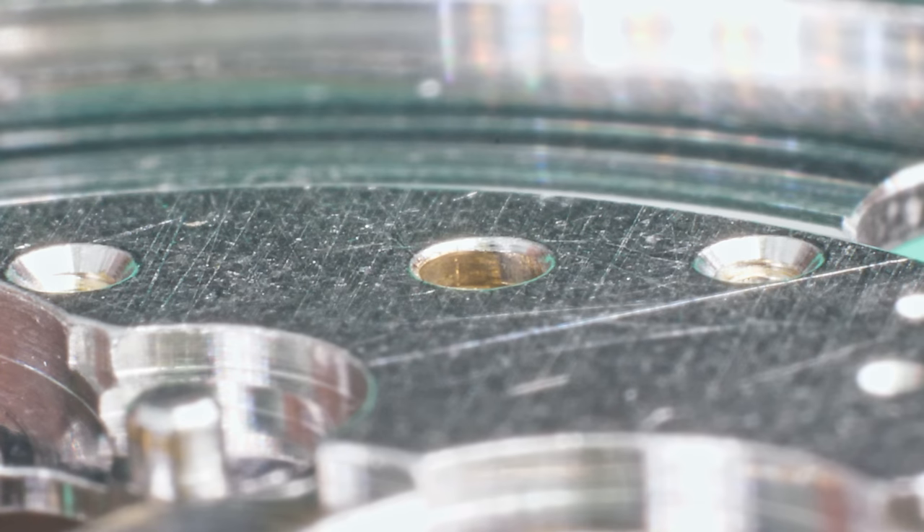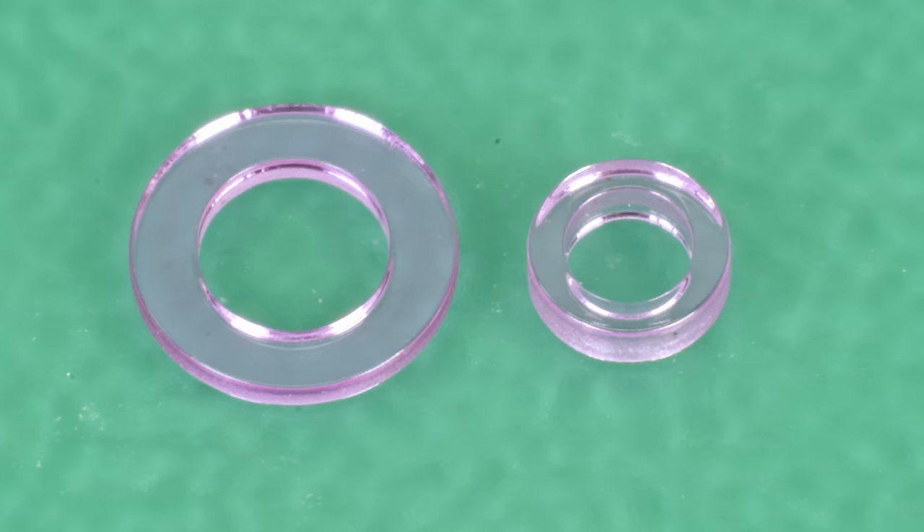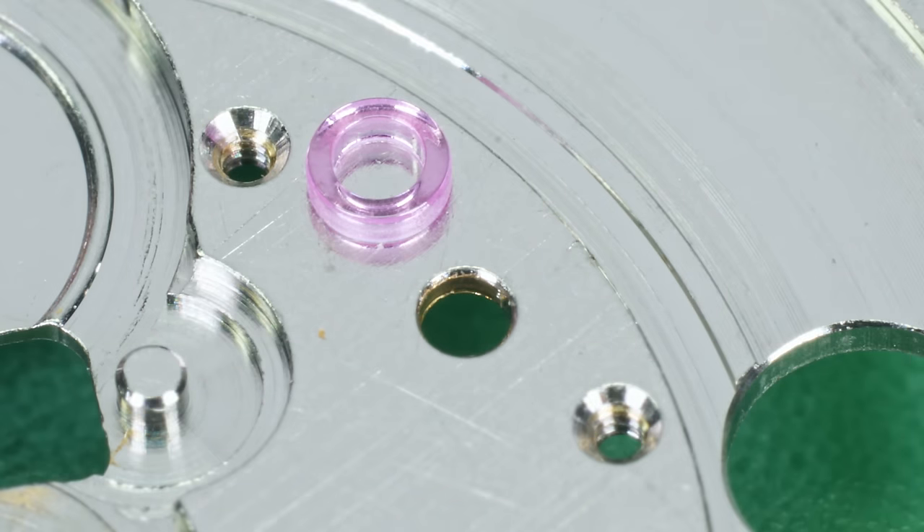It's not the end of the world. We can easily fix that. We don't have a bushing to push out in the main plate like we do in the bridge, but there is a way — we're going to put new jewels in. These are from VTA, which stands for Vintage Time Australia. They are not your standard side jewels — these are custom made for this movement. They make jewels for all kinds of Seiko movements. If you need some for yours, go on eBay and search for VTA jewels. I'll put some links in the description to start you with, and you will have to do your own research.